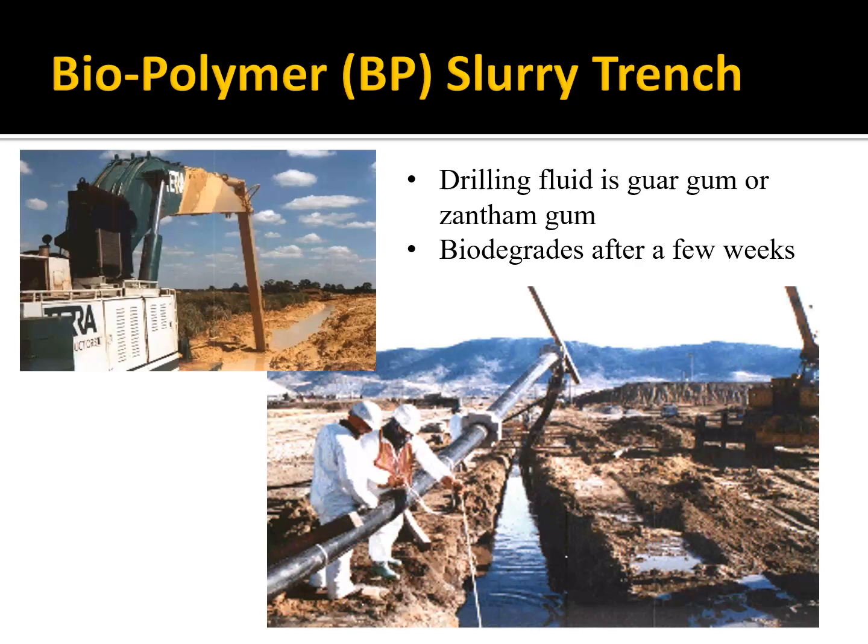Sometimes we want to contain a system. For example, if we're doing a dewatering system, we may do an analysis with our wells and find out that there's a massive amount of water we have to pump. So you can surround the site with a slurry trench cutoff wall, in which case, you dig one of these trenches, and then in that slurry you mix typically something like bentonite, which makes a highly impermeable slurry, and then you push the soil back in, and you effectively have a low permeability clay wall that surrounds your site.